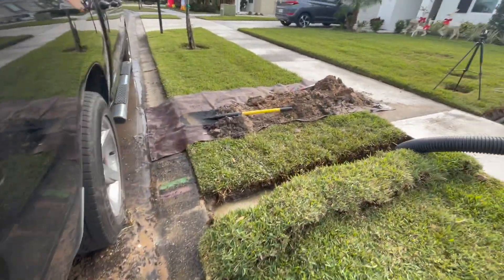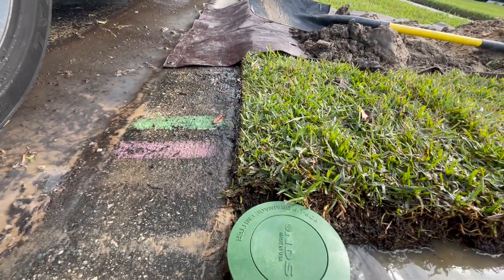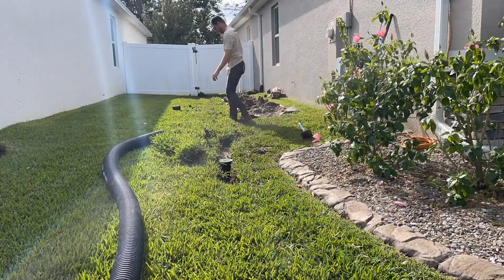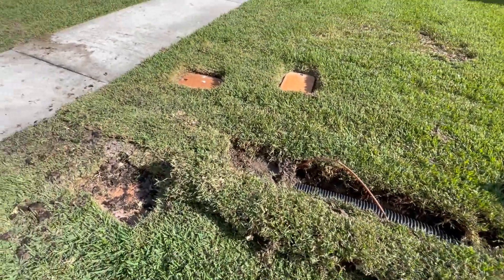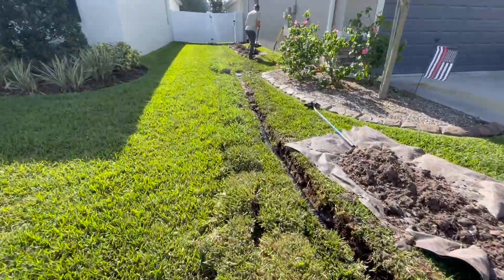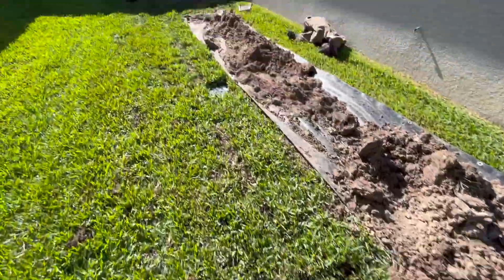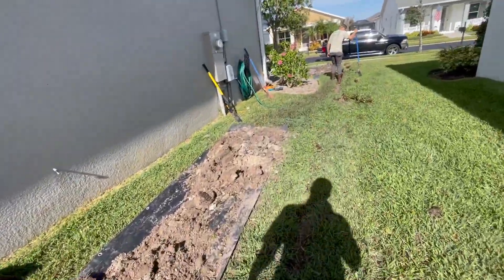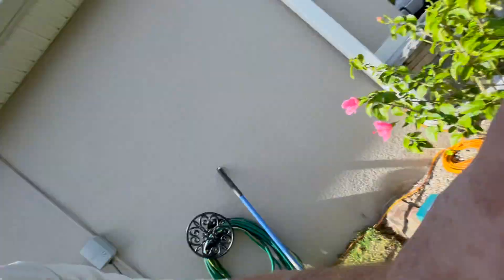Our favorite way to install pop-up emitters is under the sidewalk and right to the curb. We like to put that edge flush on the curb — not too far over where cars will drive over it, but just about there. Joe's backfilling this last section, got the pop-up emitter ready at the end, real good slope coming down. Went ahead and put some drainage rock to help filter on top of these catch basins, and he's in the corner there under the AC drip line. Get the dirt off, get rid of the excess, sod it back on — in and out in about three and a half hours. Not bad.